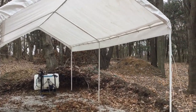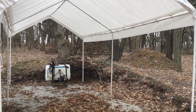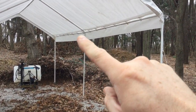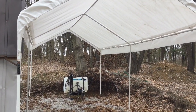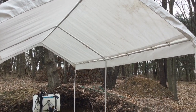By default, this is 10 foot wide and 20 foot long. But if you notice, there's only one, two, and three main supports. That leaves this span — that's a 10-foot span over there as well. That's a lot of weight, especially if you get some bad snow or rain on here. They're just going to bend.